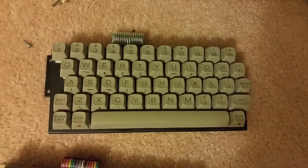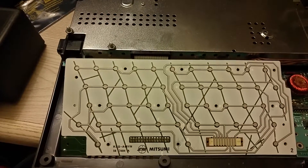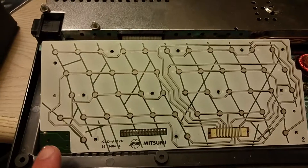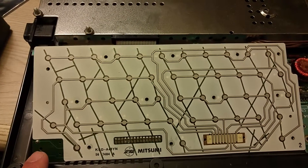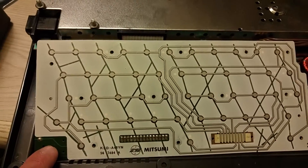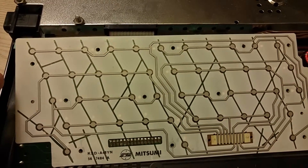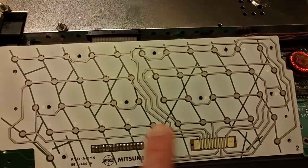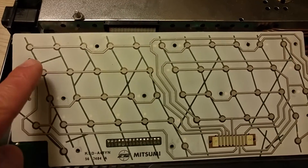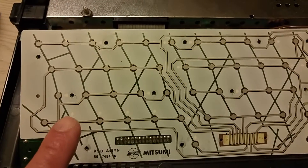Back to the original start of the video — the original Mylar not working at all. I disassembled the keyboard; you have to desolder one spot where the alpha lock key is, where it was soldered down to continue the circuit. But I basically didn't see any fault in any of the traces anywhere — everything looked totally fine. So my next thought was that maybe there wasn't a break, but maybe multiple points were just compressed, pressing down where they shouldn't have been, confusing the computer.